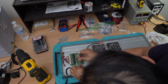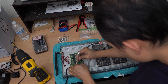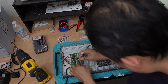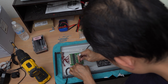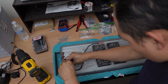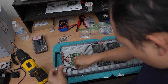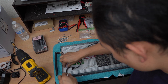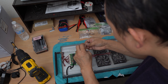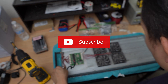I fast forwarded through all this and I have the back panel off. What I'm working on here is taking that metal side bezel off — it has the antenna right on it. So when you're doing this, just be careful because that wire is pretty fragile. You have to take off the antenna, which just pops off, and then use a smaller flat screwdriver to unscrew the power cable from the motherboard. If you're unsure on the tools needed, check out the description below — I'll post the links to the actual tools I'm using.